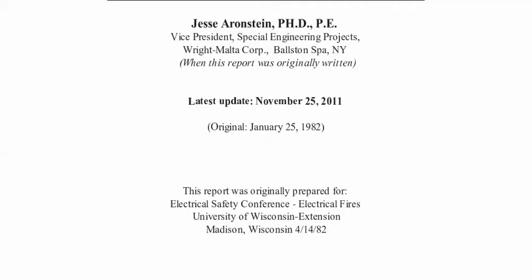If you are an electrician or working with an electrical contractor and you're looking to do this type of work, I highly suggest that you review this report before you start trying to correct people's hazards in their walls, because we have seen where electricians have gone in and used materials they shouldn't be using in corrections, and in one particular case, a house almost burnt down. I'm going to be talking specifically today about the Ideal 65 connector, which is touted as a solution for aluminum wiring to copper and aluminum wire connections, in order to get rid of the problem of creep in aluminum wiring.